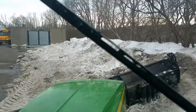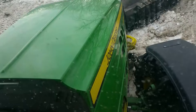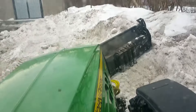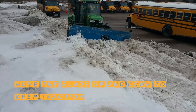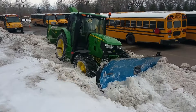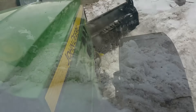I'm going to show you the best way to break up this pile using your plow. We're going to break it up so it's not so chunky and we can ride into it with the snowblower. You've got to take little pieces at a time — start at the top. By moving your plow up and down, you can keep it going so you're not sidetracked into the pile too much, but it starts to break and loosen up all those chunks. By just keeping that plow motion up and down constantly, the tractor will maintain traction in the snow, loosen up that pile, and you won't get thrown to the side as quickly.